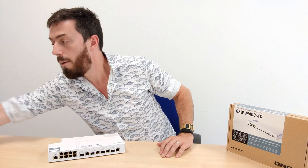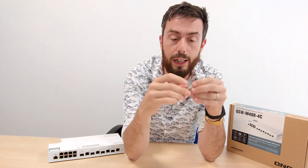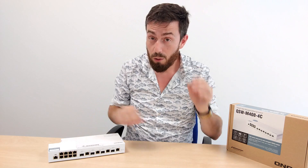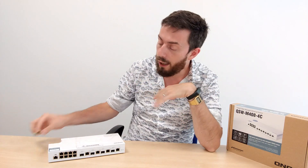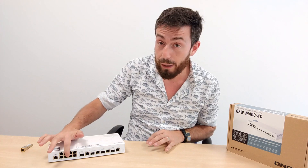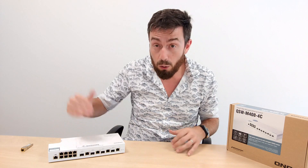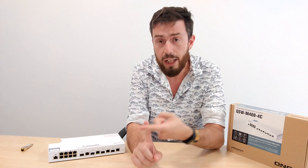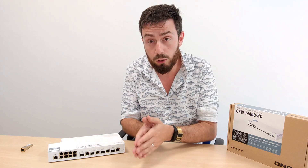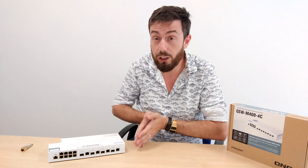It's worth highlighting that you can take advantage of combination adapters that allow you to connect a fiber device and then output copper. With these adapters - which are about 100 quid, or maybe 80 quid ex-VAT - you could effectively turn this into a combination 8-port 10GBE switch, with all those 1GBE ports for day-to-day use for low-level users. That leads on to another point about the advantages of a managed switch: first and foremost is the ability to have Quality of Service, where certain devices on certain ports will always have priority, you can limit other ports, and have tailored security precautions across each port.